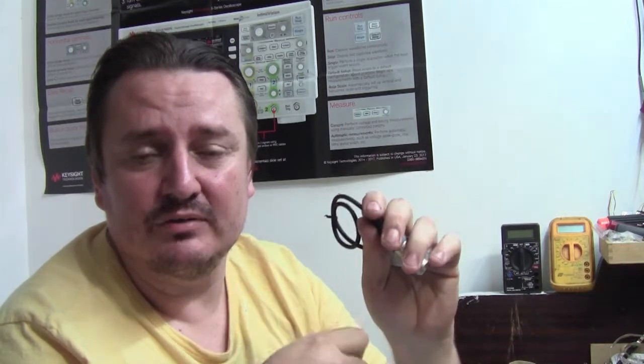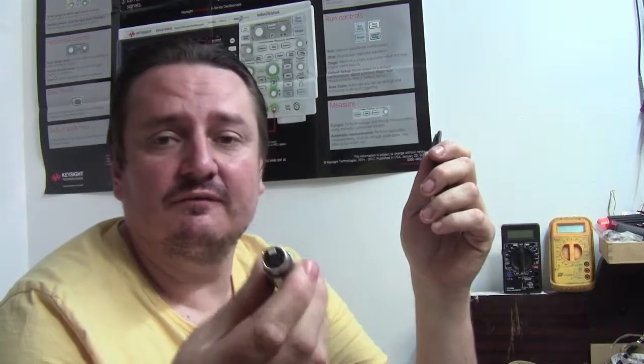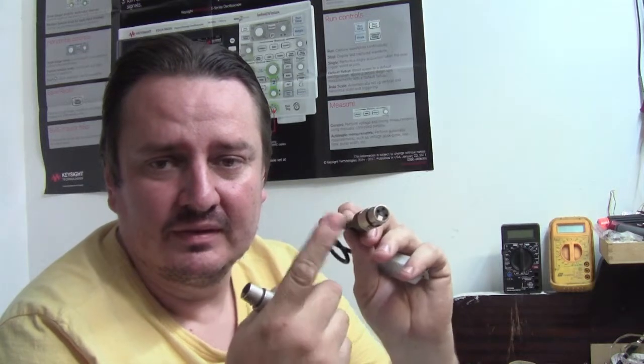It's just nicer, and it's easier to swap around if this full interface fails for whatever reason — watch my previous videos to see what causes them to fail. Then we can easily unplug it and plug a basic in and use it for five hours until we can get up and running again. So I hope you learned something interesting about the Magic DMX full and basic interfaces and the connectors they come with. The basic interface has three pins and can only run for five hours before you have to unplug and replug the dongle and restart the program. The full one comes with the five pin interface and it's non-time-restricted.